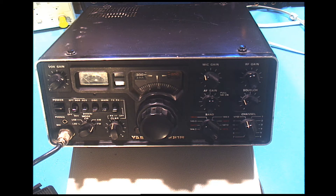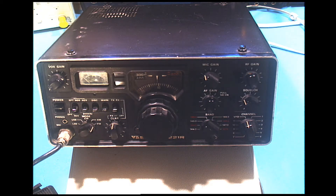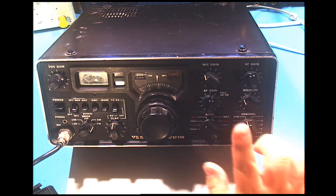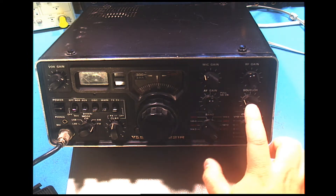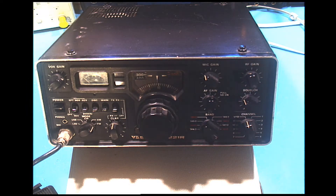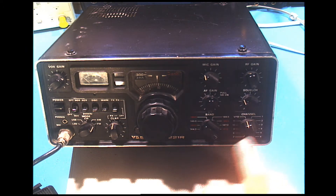I've looked it over and we're going to do a full repair and restore on this transceiver, including alignment. The current known issues are that every single pot and every single switch inside is dirty. The AF gain, or volume pot, is quite dirty, as is the squelch, which makes setting things up really interesting. The band switch here for setting the VFO band is also dirty.